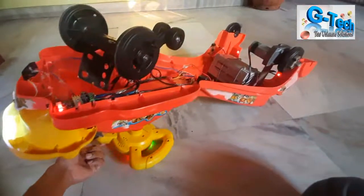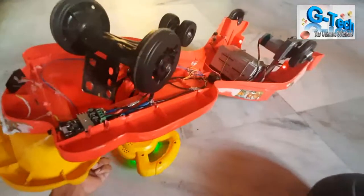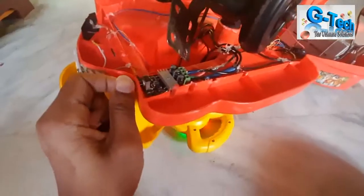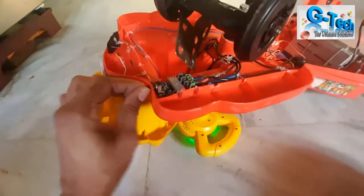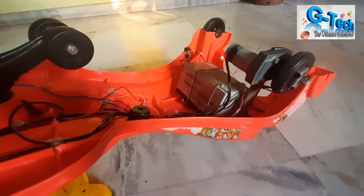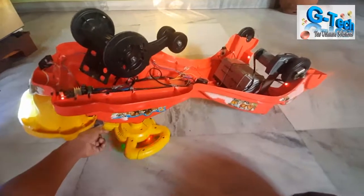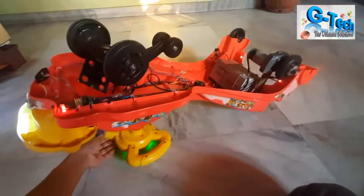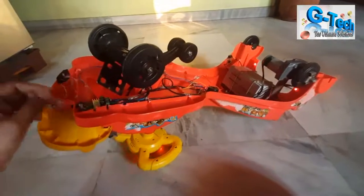This is the main button — when you press it, the MOSFET switches on and off, working as a touch switch. You can see the wheel is running now. This is the speed controller I mentioned — I can change the speed. If I press this button the wheel moves very slowly because the speed is reduced. You can choose any speed you want — now it's moving forward very slowly, and now I'm increasing the speed.